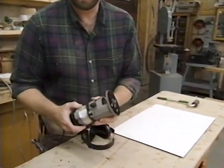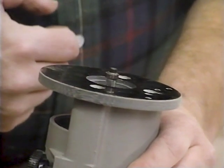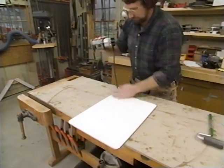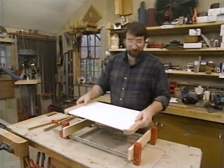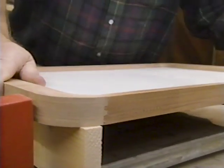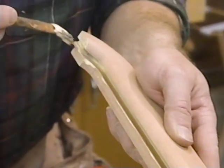To trim the laminate, I'm going to use what's known as a laminate trimmer. It's very much like a router — a little smaller motor and a smaller base. I've installed a laminate trimming bit, which has a ball bearing that will ride against the substrate, and the cutter will remove the excess laminate. Before I apply any glue to the joints and to the tray, I want to do one more dry fit, because once the glue is set in place I won't be able to make any further adjustments. That's going to be fine — I think we can glue it up.